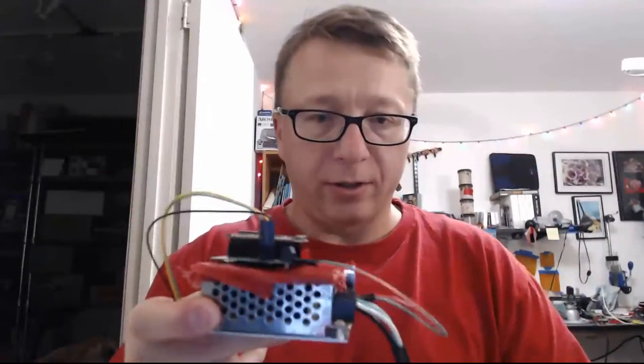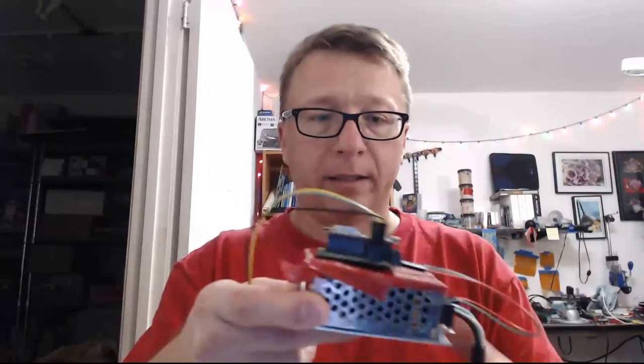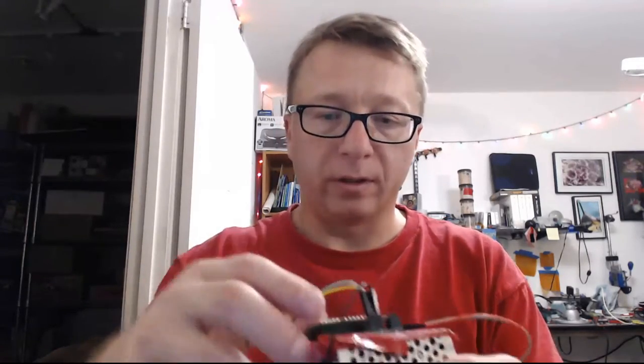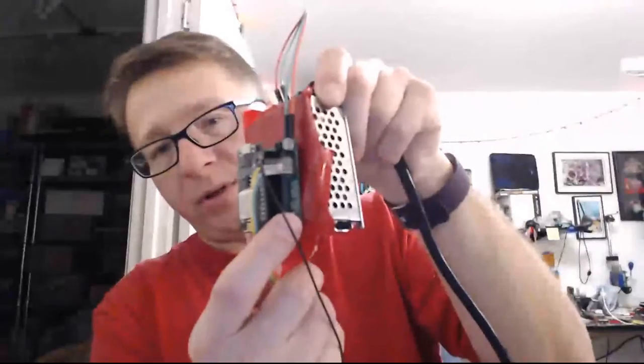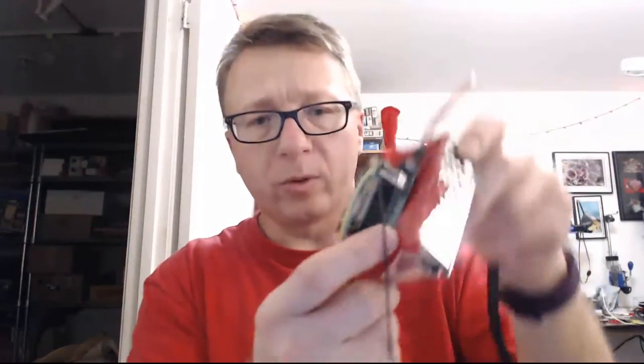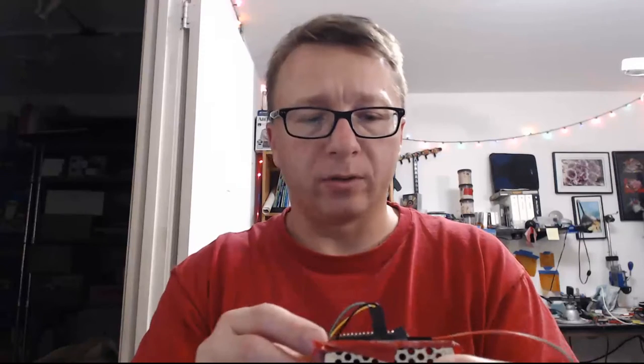To start off, let me grab this guy right here. This is actually a combination of a 5 volt power supply and a NodeMCU module on the bottom here. You can see it is a printed circuit board that I actually made to serve as a kind of a motherboard, for lack of a better term, for the module that brings the power out and brings the connectors out, and there is a little space for a capacitor here to do some decoupling of the power supply, which is required.